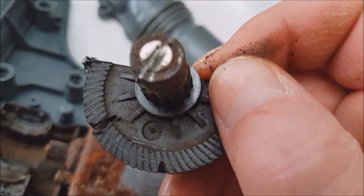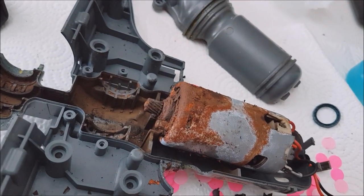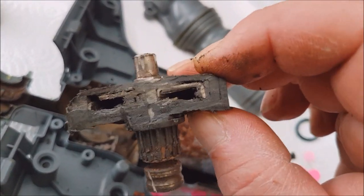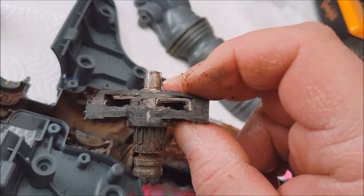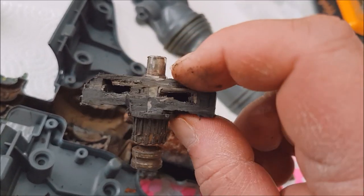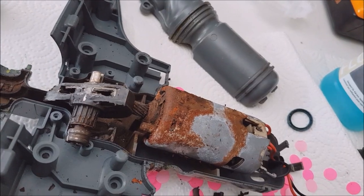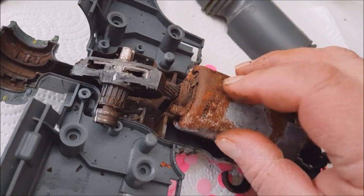Could this have been prevented? The answer is yes. This is a ratchet-type clutch — pretty much comparable to the torque limiter on a cordless drill — except this one has only one factory setting. If it had been protected by even the slightest amount of water-repelling oil, water would have had no effect on it. But it was delivered assembled without any protection.